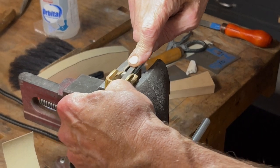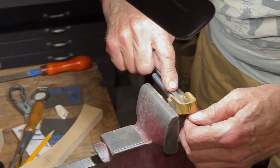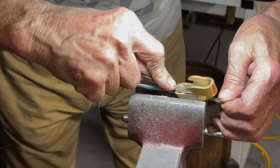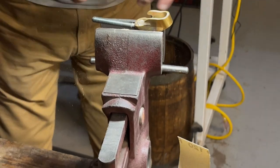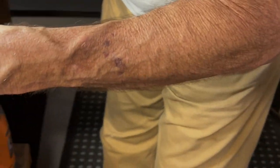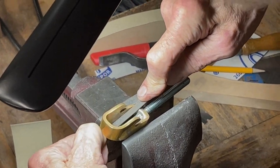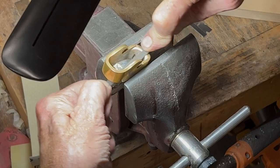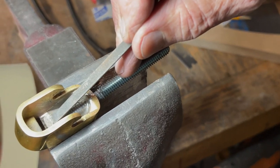Oh, that's interesting. Looks like the surface that the blade lands on isn't very good. So we're going to have to file that. Ideally, it should be a tiny bit hollow left to right. Flat or maybe a tiny bit hollow, so that the blade is nailed down tight when the clamp is applied. So you can have a look in here and see this odd surface.